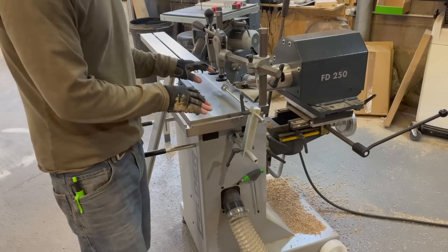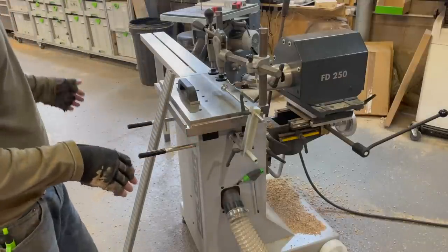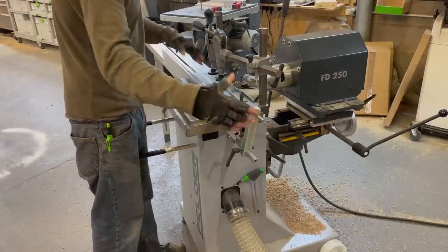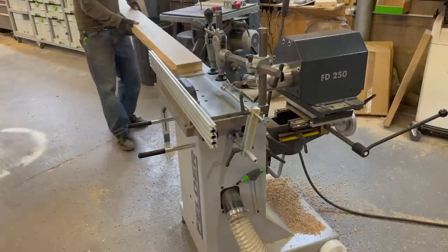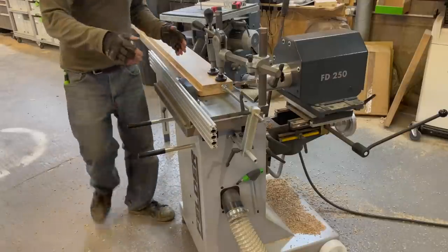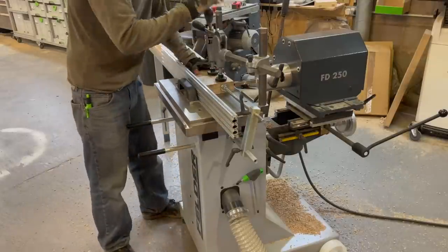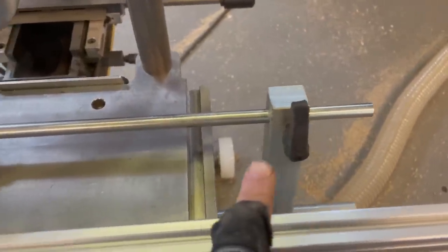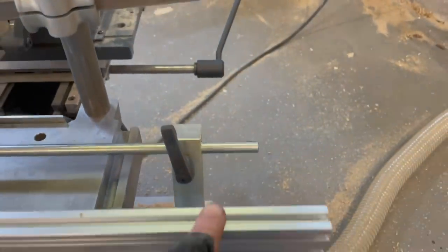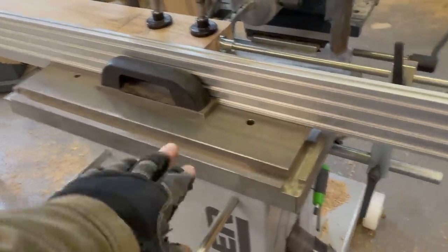This is another good option — using one extension and the Felder stop on the other side, so the other extension stays out of the way. It's a really quick stop system for repeat work. If you had a lift table you could put it there; mine are all busy holding other things. I'm just using a spacer to get the bit positioned — this is 20mm but you can use anything. Slide that onto the stop and lock it in — the Felder stop is adjustable and there's an extra silver bar on the back you can extend to slide the work right out.